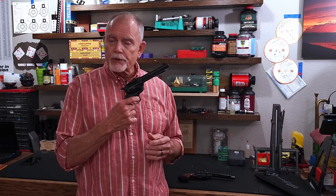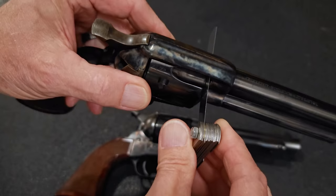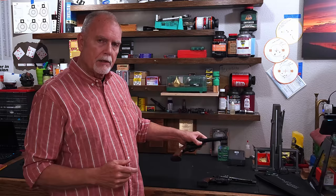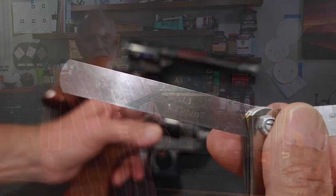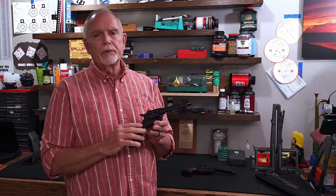For all of their good looks, they were fun to shoot — really a joy with the single-action trigger pull, and also with the hammer cock on the Taylor-tuned. Fantastic guns. But there is something we need to talk about: the barrel-cylinder gap. On the standard model, the barrel-cylinder gap is nine thousandths of an inch. I never had any sense of spitting or misalignment of the cylinders — the lockup is good and solid — but nine thousandths is a little bit on the high side for me. The Taylor-tuned version has a barrel-cylinder gap of thirteen thousandths of an inch, and for a gun that has been to a Taylor's gunsmith here in the United States to get tuned, that is really an excessive amount of barrel-cylinder gap.